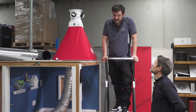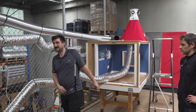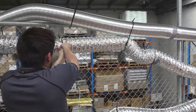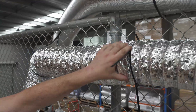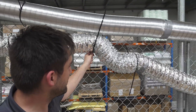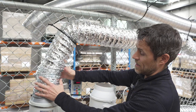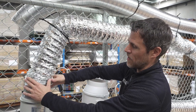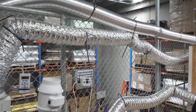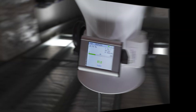There's more we can do to make it look even more typical. Over-fastening can reduce flow — your builder wants to make sure it's not going anywhere, so they make it as tight as possible with all the restrictions. This is also really common: rather than cut a length of duct to size, you just scrunch the extra duct onto the fan. You just use the extra up like that and squish it. Now we've got 81.8 liters a second. Less impactful than the sagging, but still reducing your flow. It's all accumulative.